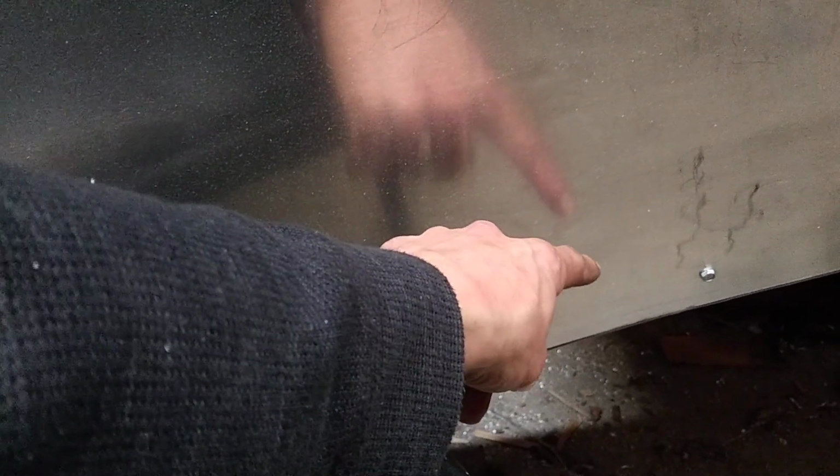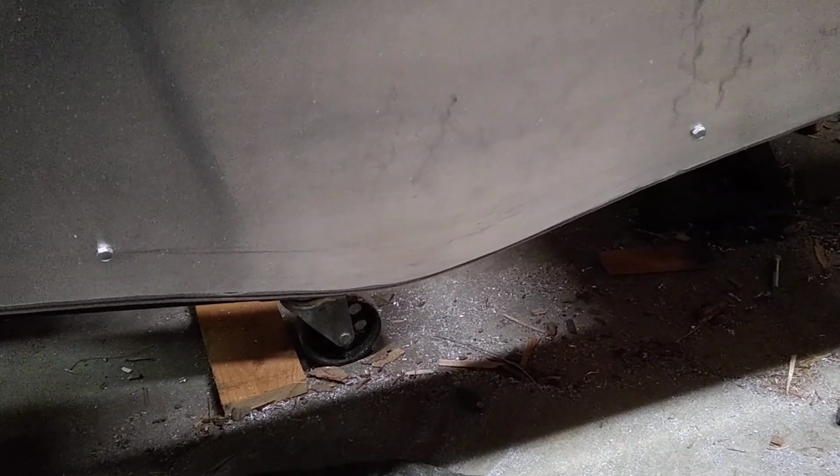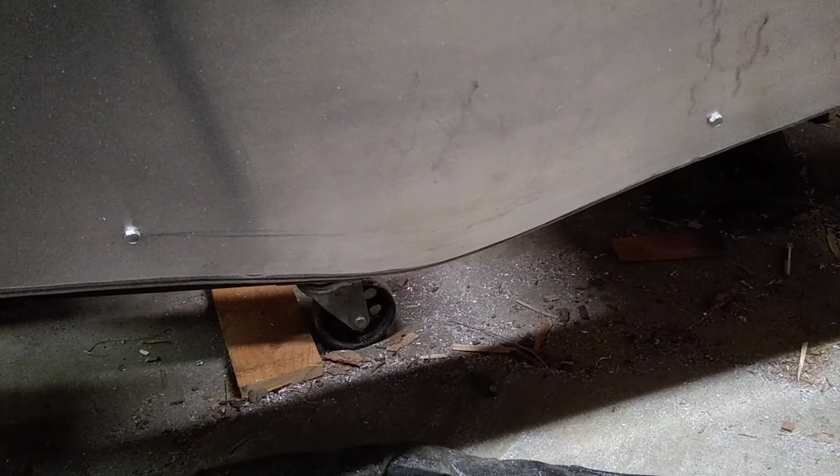So yeah, one other thing I thought about too is, considering I got this going all the way down to the very bottom of the boat, and it's pretty thick, the Berkeley drain plug winds up on the transom housing, like kind of far up. It's kind of like way up here. I debated on, maybe it's not one that you use every time, but maybe in the very bottom here you could take a thick, like Schedule 80 aluminum pipe bung or something like that, and put a brass pipe plug right in the very bottom, so you're physically draining as much of the water out of the boat as possible. But I guess we'll get a look at that when I get the transom housing up on here and screwed on after the hole is cut out of it.